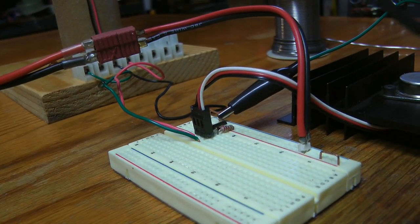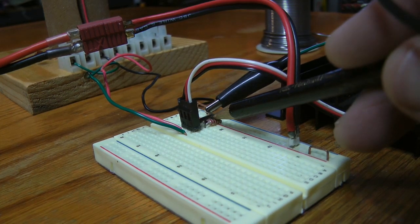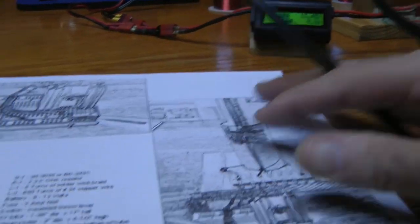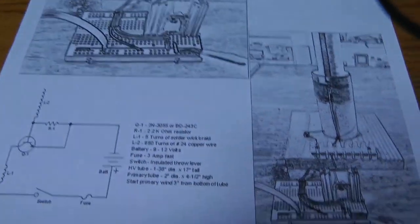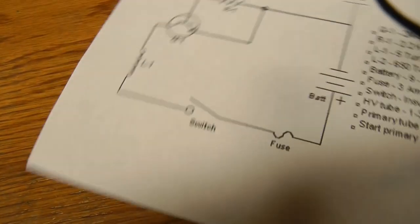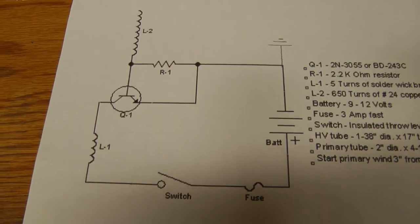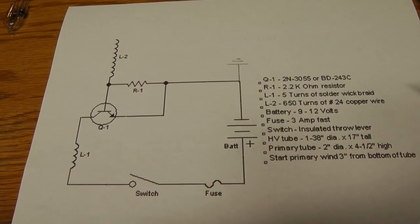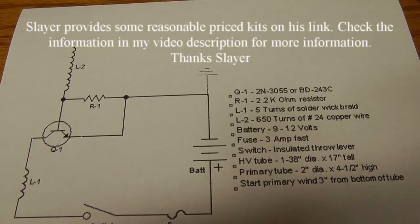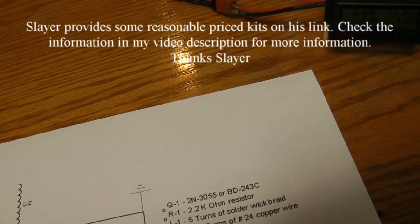The circuit is the Slayer circuit. There's a resistor there, there's a diode behind it, and there's a transistor here - that's it. Let me turn this over - so this is the circuit, and that's all there is to it. Don't ever forget your grounding. You don't want to miss the ground - your instruments will go crazy if you try to measure anything. Just be careful, but I think this is probably safer than a big old spark gap. You can learn a lot from this.